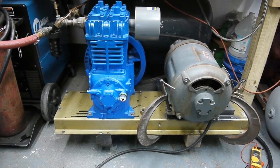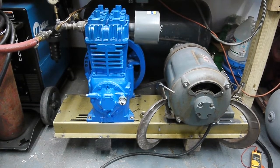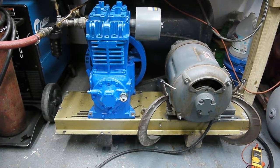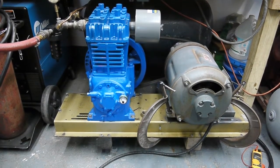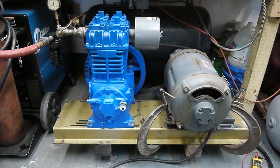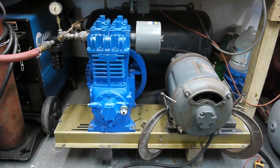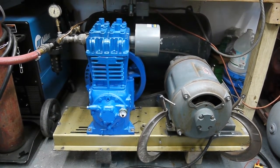However, this motor will get extremely hot without any external cooling. After about 30 minutes without any cooling, the case of the motor gets to 177 degrees and the windings get up to 217 degrees. But with a cooling fan, the temperature of the case drops significantly — down to around 145 degrees on the outside of the case, and the windings were only at 170 degrees. That's a 30 to 50 degree Fahrenheit temperature drop just from a fan blowing through the brush inspection cover and pushing hot air out of the part of the motor where the two phase wires come out.